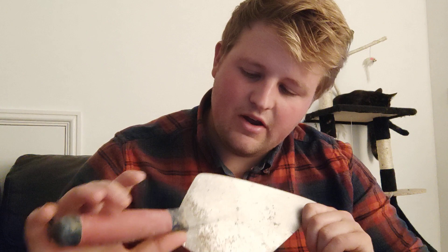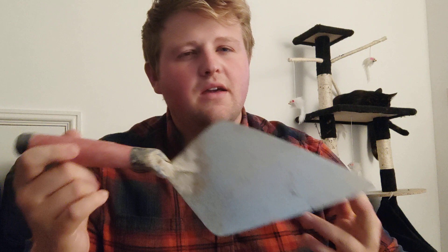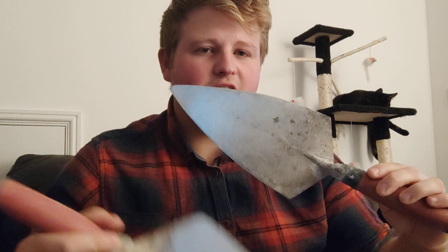Since I've been on YouTube — the channel's been going about eight months — I've been using this trowel. I'd say 10 inches is sort of where you want to be; you don't really want to be going any lower. You can probably use a 9 if you've got the right setup for pick and dip. I've mixed my time between a Philadelphia and a London. This is a Marshalltown 10-inch London, and this is a Tyzac 10-inch London — these two trowels are both good.